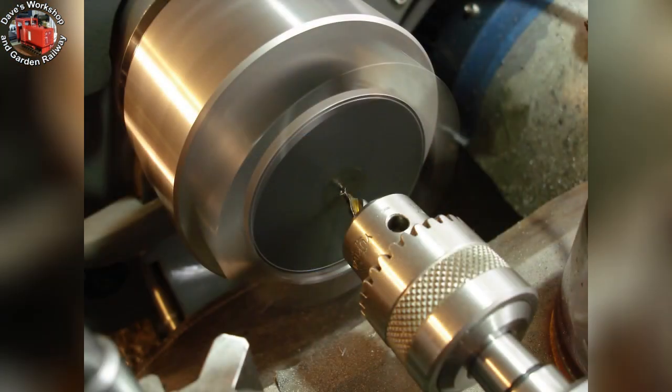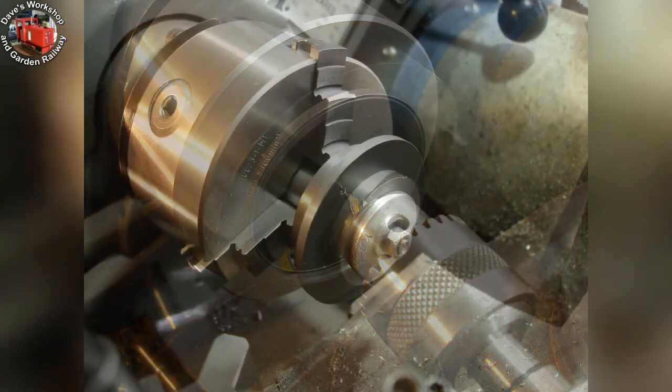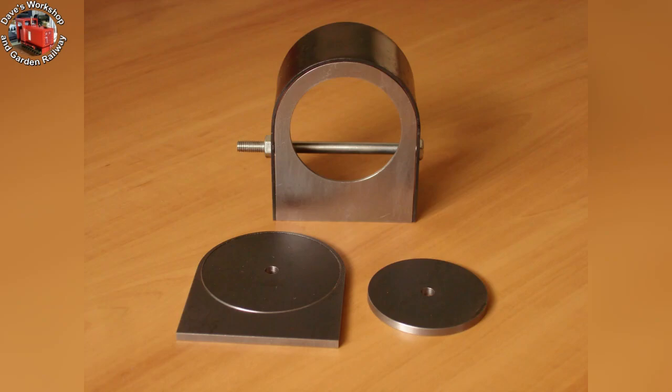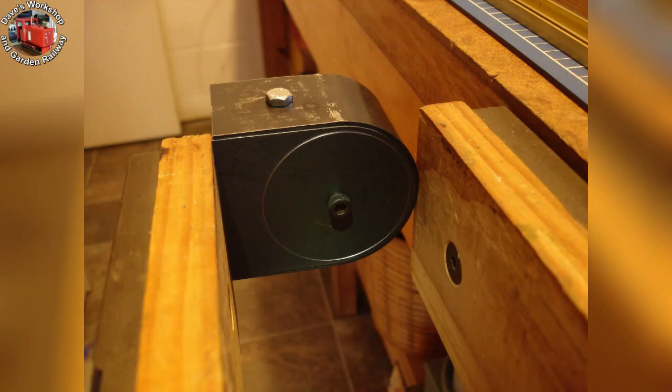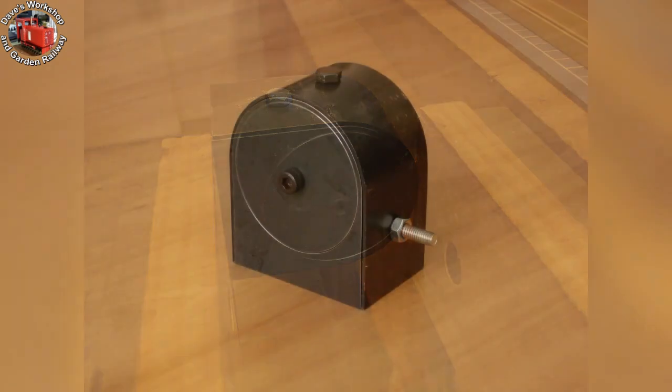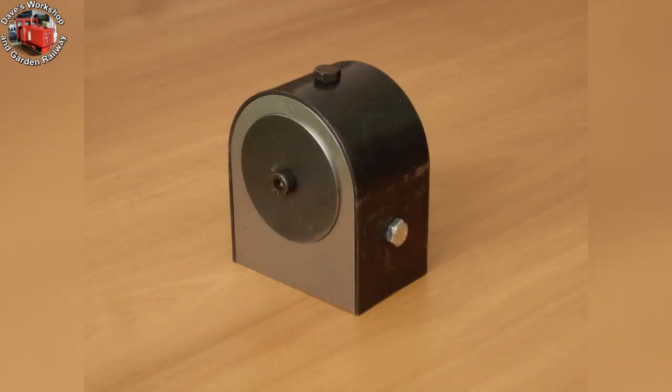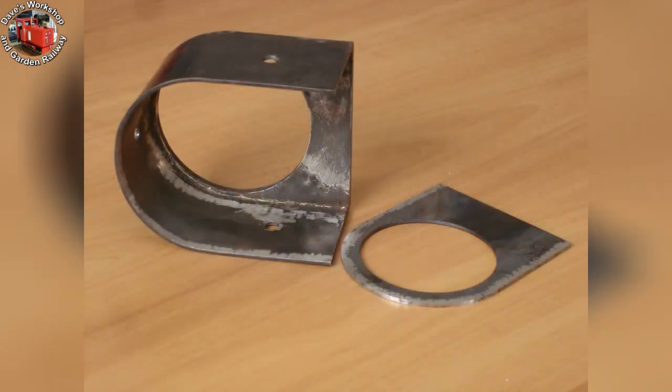I realized that some discs were required so that I could apply some force to the wrapper via the end plates to finish-form it. The discs were cut from the 4mm steel and rough ground to shape, then drilled through 6mm for mandrel turning and fixing screws. Turned to size on a loco wheel turning mandrel. Checking the fit — this disc blank will stop the thin wall from deforming. Both disc blanks finished. Applying a bit of persuasion without risk of squashing that lovely back plate. All screwed down and tightened up. Ready for heating to red heat to anneal it in the correct position. The top screw pulls up the center bar, holding the disc blanks, pulling the end pieces into the wrapper radius. The back plate has been silver brazed. The wrapper did not move on heating — the annealing was successful.